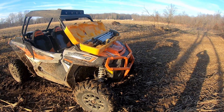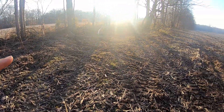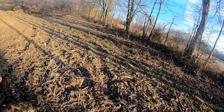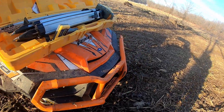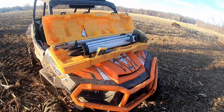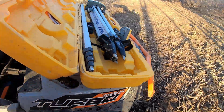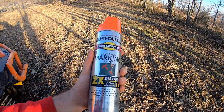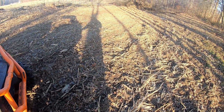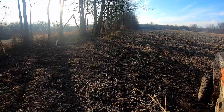Okay, now we're on phase two, and that is to figure out where the high side is and where we need to get the water drained. First step — this is a laser transit. If you don't know, it's basically to figure out grade. First things first, get this set up, and then we're going to find the highest point and mark it with an H. From there, I need to measure from the corner to where it's going to go into the woods.